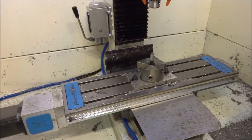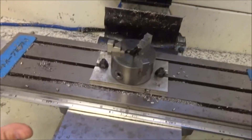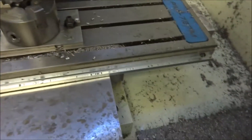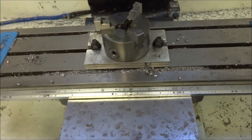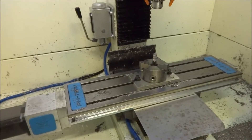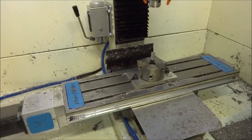I'm out in the shop today. In the last couple of weeks I've noticed that my chips and my parts when I run them are turning dark really quickly. You can see how dark and dirty these chips are. I think something's going on with the coolant — the pH or something is getting out of whack. I haven't really done anything to the coolant since I first installed it, which was last August, about a year ago.